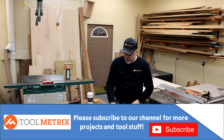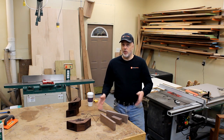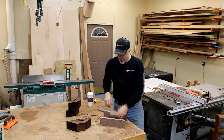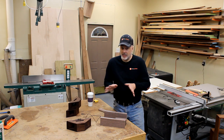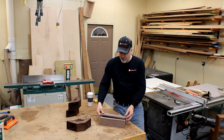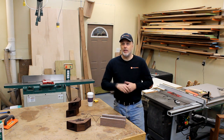To get started with the project we have four pieces of wood. I used walnut — I think it works well for this project, but you can use whatever wood you want; I would suggest a hardwood. You've got the front and back, and I'll put the dimensions up on the screen now — if you want to pause and do a print screen, you should be able to take that out to the shop and get the pieces rough cut. This is a base that we're going to cut in half to create the sound amplification ramps going out each side, and then this will be the top piece.